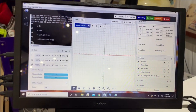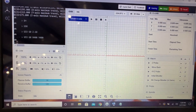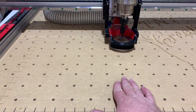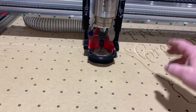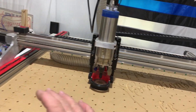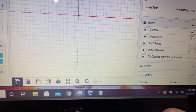Just like in my last CNCjs video, all the macros you can still program — it's almost identical. You just have to remember that the coordinates on the X-Carve new carve are going to go in a positive direction since it homes in the left front, whereas on the Shapeoko over there it homes in the right rear, so all your coordinates are going to be negative. Keep that in mind when programming your macros.